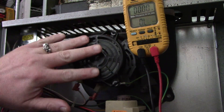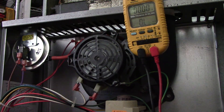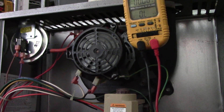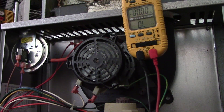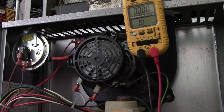This whole black piece right here — this part right here — that's the inducer motor, inducer assembly. All it's designed to do is draw air through the burners and everything, through the heat exchanger. It's not going to push it through the vent system; it's just going to let the air go through the vent system like that. The hot air takes it away.